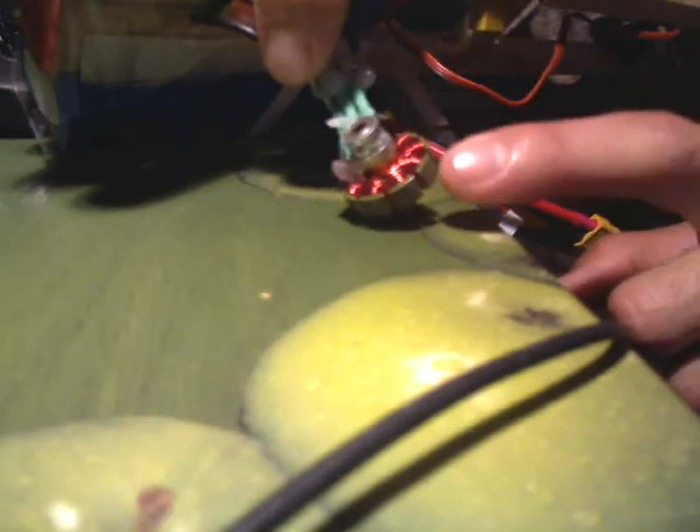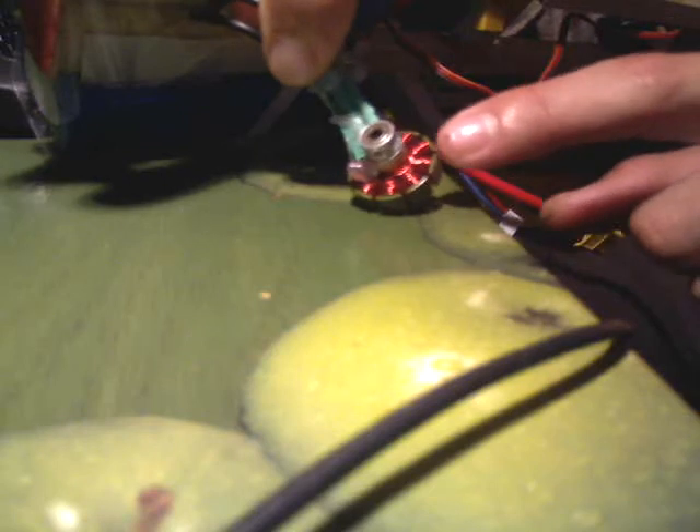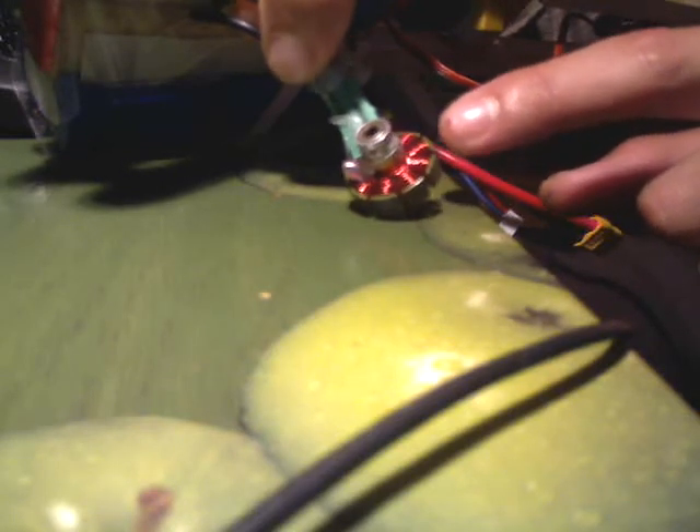Now, this motor is different. I took a gauge smaller and used three strands like on the previous winding, but the wire diameter is smaller, so I was able to get about 11 wraps on each phase. So I'm only drawing about 10 amps, giving me like 120 watts, which is much less, but it's not burning out any speed controls.